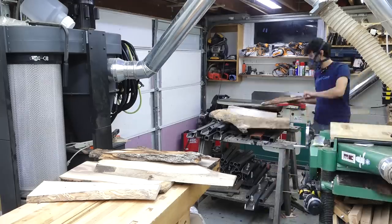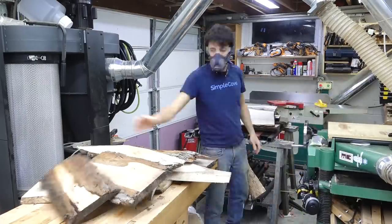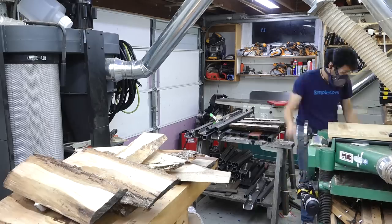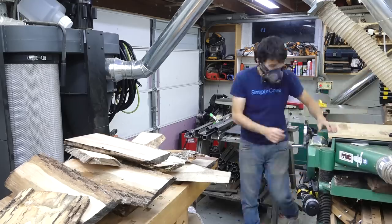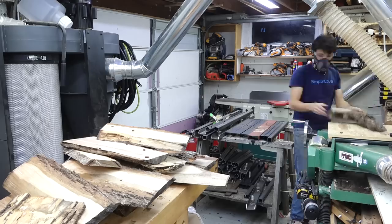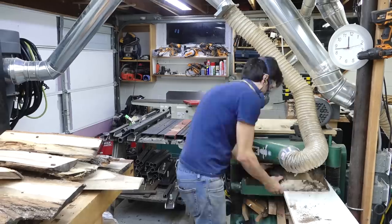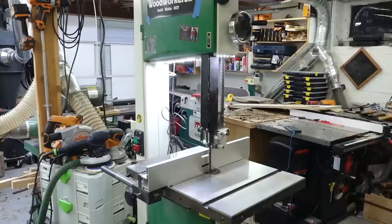This first milling process is going to remove a lot of the waste material from these boards. They're all different sizes, thicknesses, and shapes, and since they're just sitting in a firewood rack they're not going to be very flat. Checking the pieces with my moisture meter is giving me readings around 15 to 20% for some of the newer stuff — too wet to use right now. Removing as much material now will allow them to dry faster. Once milled up, I can stack them in the shop and let them dry for a few weeks.